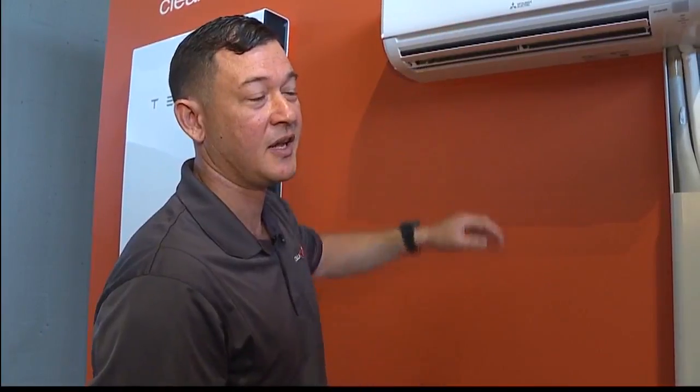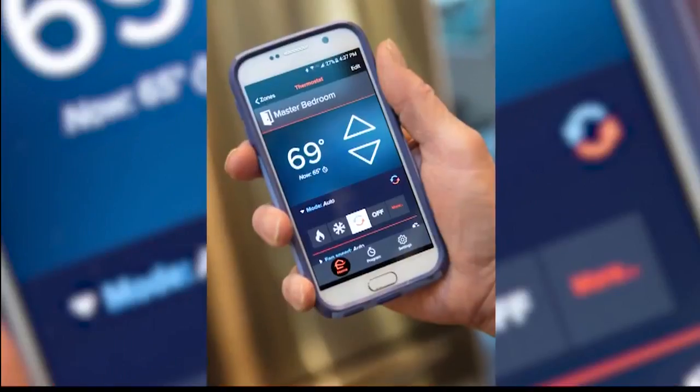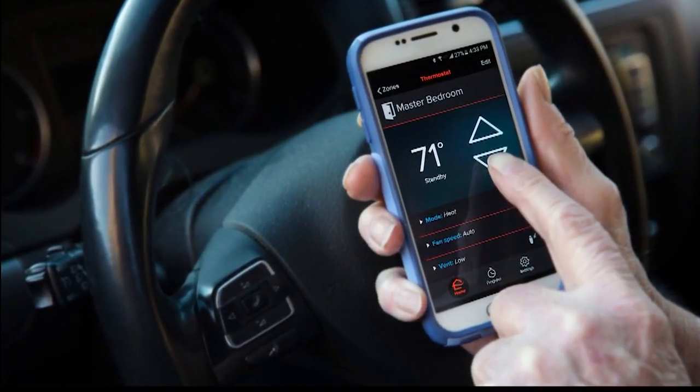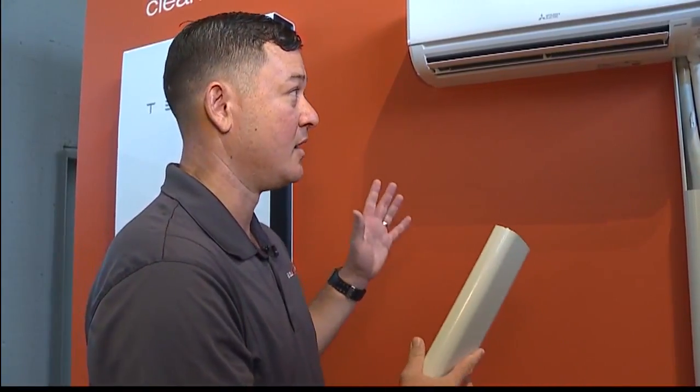A lot of people may be used to the old style of air conditioning where units were really noisy, but these are actually really quiet. We had a client who just had her air conditioner put in and she called and said it was a little noisier than she thought. She probably had the fan on high — there's the cooling side and then there's a fan in the indoor unit. She actually called back and said she figured it out: the fan was set to high, she turned it down, and she can barely even hear it. Another feature is what they call kumo cloud — they're getting on the smart home technology bandwagon. You can have this indoor unit connected to the web and an app on your phone, controlling the temperature of your home from the road. You can turn the air conditioner on 10 or 20 minutes before you get home, and you can also set the thermostat up a little bit to help with the overall energy efficiency. That's why Mitsubishi has been recognized as the most energy efficient air conditioning system on the market today.